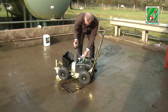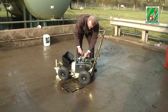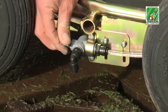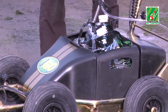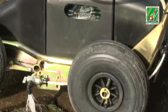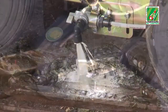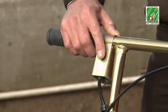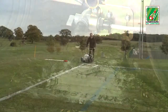The paint transfer tube is removed from the priming bottle, placed in the eco bag and screwed down providing a tight seal. The lid on the priming bottle is replaced and the cover returned to the closed position. The on-off button is pressed again to allow the paint to be pumped into the pipes. The pump will first expel the water in the pipeline, and when paint emerges, the on-off button is pressed once more to stop paint flow. The line marking can now begin.